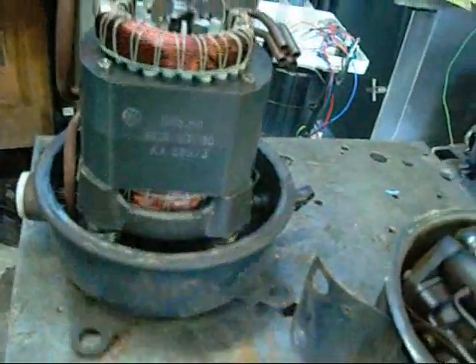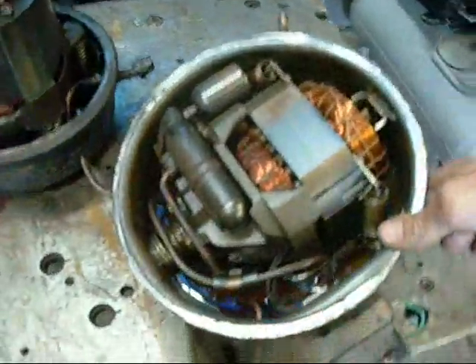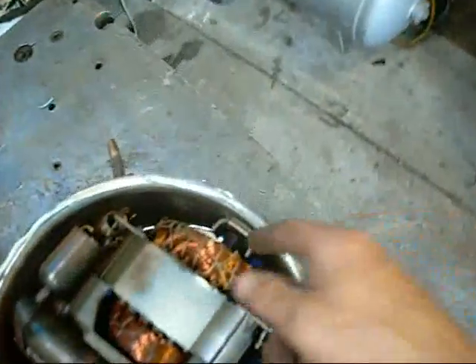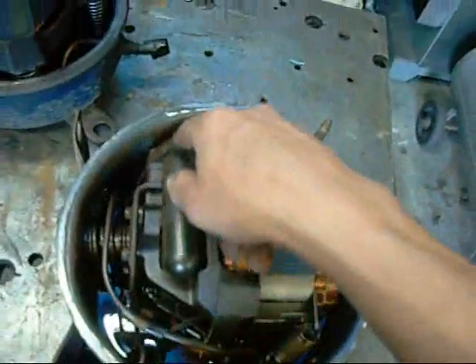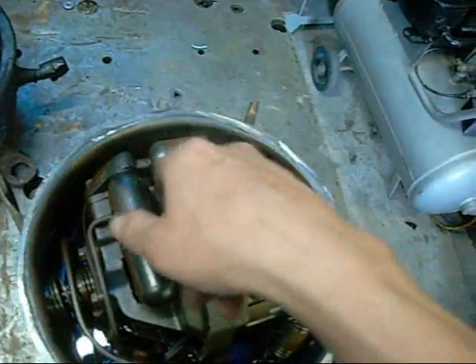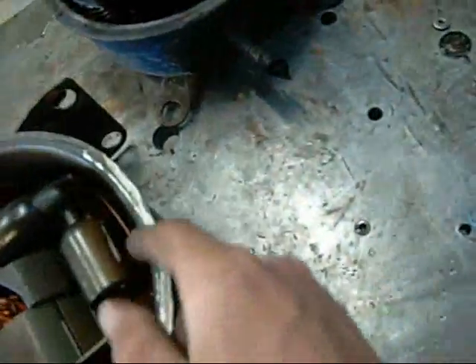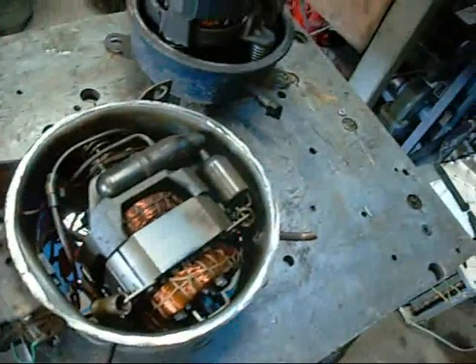The motor is actually made by General Electric so it could be a standard GE design of that era. And this is the pancake one - it is supposed to stand upright but it has oil still in it. Similar sort of style, single cylinder. There is an intake I think, that is a discharge, that would be a discharge oil accumulator. Discharge is coming out here, suction is on the far side I think. This one is still hooked up to a run cap and everything so I will be able to wire that straight up and run it. I will just drain the oil out and let it rip.